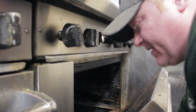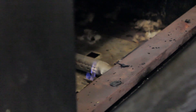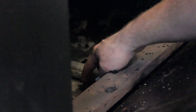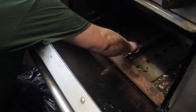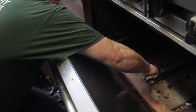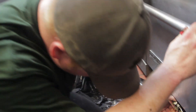See the flames barely touching that sensor, so therefore it's not going to stay lit. It's got to cover this all the way. Same thing — the pilot's completely clogged, no gas coming out. The pilot's going to need to be replaced also.